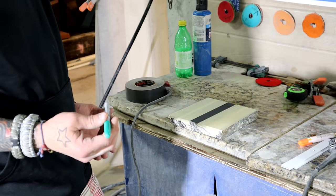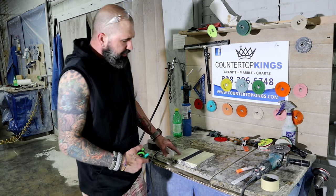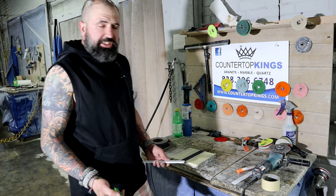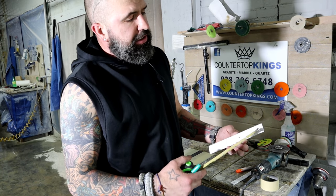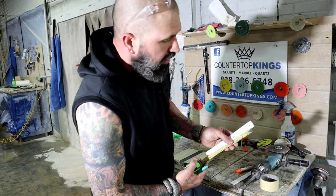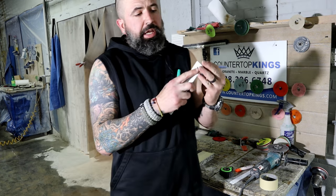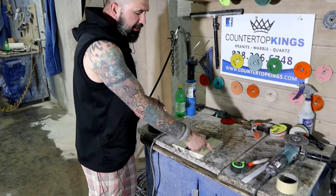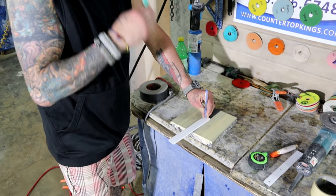How do you make a perfect circle? All right, it's really, really simple. This is 8 inches. I want an inch left over everywhere, so I want a 6-inch circle. So I got me a piece of sign material, template material. I put me a hole in the center here, then I measured 3 inches off of that, and I made me another hole. So what I'm going to do is get me an ink pen, a screwdriver, something sharp, and put it through that end of the hole. I made me a center mark, 4 inches, 4 inches. I'm going to take this ink pen and poke it right there on that center.